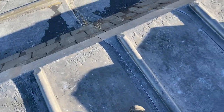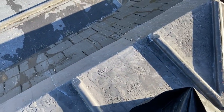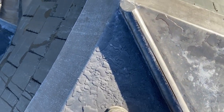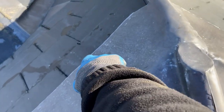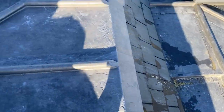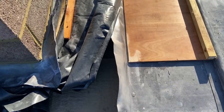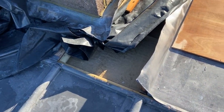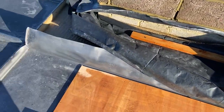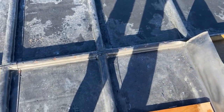That's these two end sections finished now. All that lead's turned into the Nicholason vent as far as we can go. Can't do these bays here at the moment because we still need to run this hip up so we can cut out the extra thickness off there. So I'll leave those ones for now. What I'm going to do now is concentrate on this ridgeline. I would ideally prefer to get all the bays in first, but the scaffolder hasn't worked his magic yet - I don't think he's coming until Friday. So to keep things moving along, we'll crack on with this ridgeline.